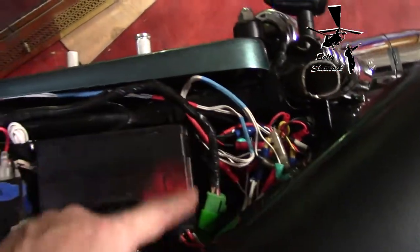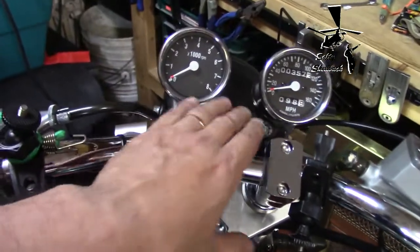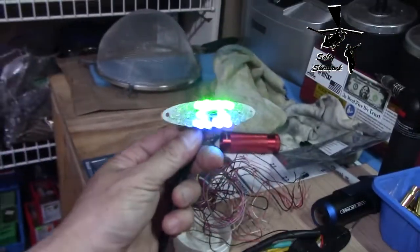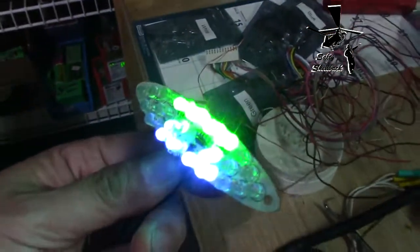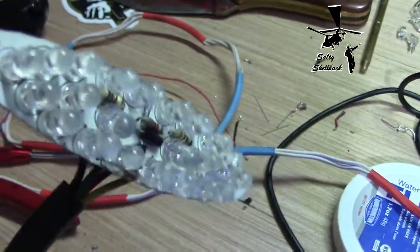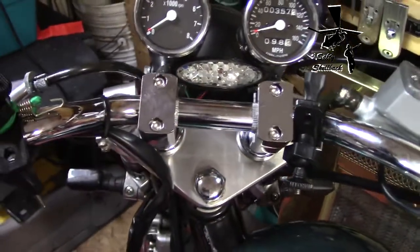The other thing I had to deal with — when I first started soldering the new LEDs, the circuit board was so cheap. When I went to desolder and re-solder the new LEDs, the circuit board didn't have enough metal — it was so thin that when I desoldered the old LEDs, the traces melted away. So I had to make jumpers to the LEDs to make them work.